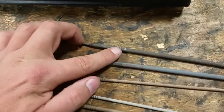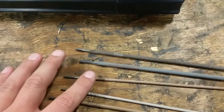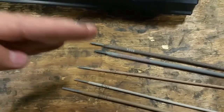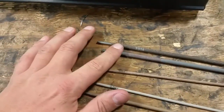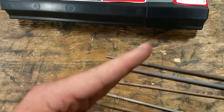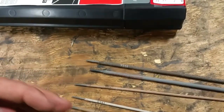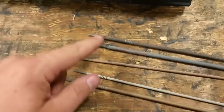The next number in the set — after the 60 or 70 — is the position in which it welds. That's going to be one of three different digits: a one, a two, or a four. The one represents every position, meaning you can weld horizontally, vertically, overhead. A two means it can only be used in a flat or horizontal position — if you try it at an angle it won't stay, and it'll fall back on you overhead. A four is also an all-direction rod, but it's specifically for vertical down. So you have vertical up and vertical down — that's what those numbers mean.